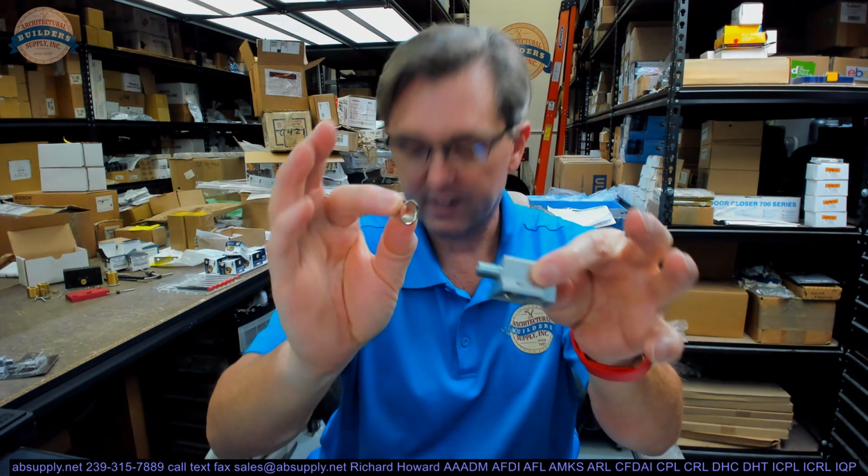If you had the application that they're showing you where you're locking the door biased on the outside, you'd then just have this little, what we would call a thimble strike. That's how that would work. You're going to get screws for everything. You've got more screws here than you need. This package has 4 screws and 6 screws. You only need a total of 4, so there's a couple of extras. That shouldn't be the case where they're sending extras.